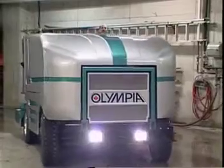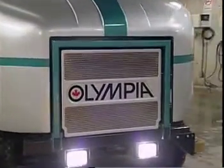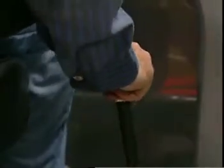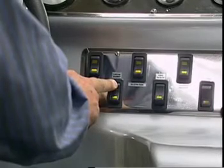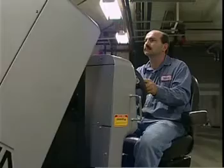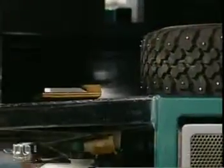After unloading the Olympia from the transportation vehicle, drive it to your maintenance area. Come to a complete stop, shift into park, and leave the conditioner in the raised position. After parking, check to ensure there is adequate top, front and side clearance. Push the top of the snow dump control button on the dash and hold until the snow bin is raised sufficiently to remove the parts inside.